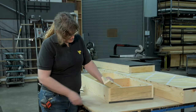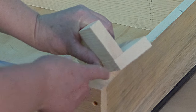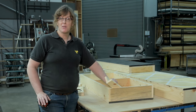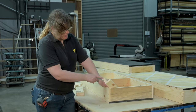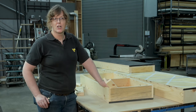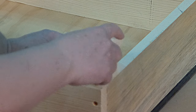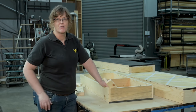If we want to talk about hog's trough construction, you can see straight off the bat here that this is a piece of one by three and that's a piece of one by three, but it's not symmetrical. So if you want your hog's troughs to be symmetrical, you're going to have to rip two pieces of one-by — rip this one to be two and a half, and then this one needs to be three quarters of an inch longer, so three and a quarter. Then you will have a more symmetrical hog's trough. I'm usually in more of a hurry to bother with that, so I just live with this and accept the imperfections.